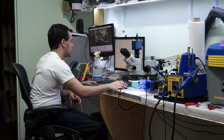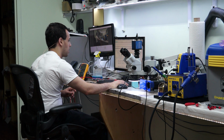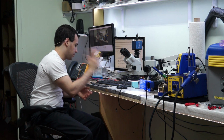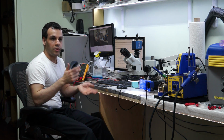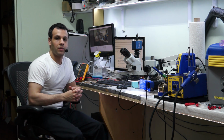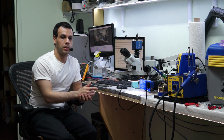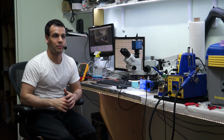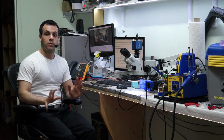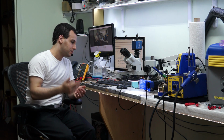So anyway, PCH_CLK_32K_RTCX1. Now, if you know anything about how computers work, you probably know that they work based on a clock. For different components to work in tandem, they have to be working on a clock. Think of it like audio. If any of you work in audio and you have, let's say, a digital to analog converter and you want to run another one. So let's say you have two digital to analog converters. Instead of having 16 channels, you have 32 channels because you want more tracks. You need to link them together or else you're going to get something called jitter, which is a nightmare and a terrible, awful sound because they're not working at the exact same time. So this track is going to be moved in phase versus this one. It's just a whole mess.